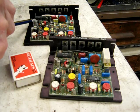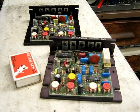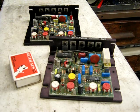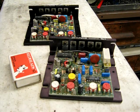The circuit board is mounted onto a little alloy heat sink. You bolt up the unit in your protective case on these points. You want to obviously keep metal cuttings, oil, and water off of them, and stay away from vibration as well. These particular units are quite cheap to buy off the internet — $60 to $75 should get you something. And even though there are various revisions, they all work the same way and have the same functionality.